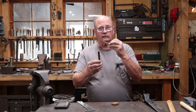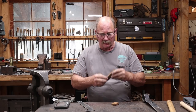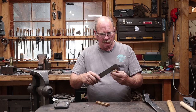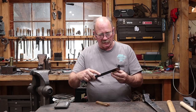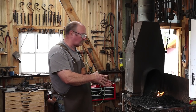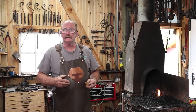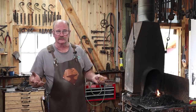His hook was a very nice contemporary or industrial looking hook, fairly much full dimension of the material for most of it, but I'm going to have to draw this out and make it a little thinner, a little more graceful. It needs a standoff — I'll cut that out of this. There'll be a punched hole mortise and tenon joint, and then a back plate. The only piece suitable for the back plate is about two inches by inch and a quarter, again half inch thick — so 13 millimeters by 33 millimeters by 50 millimeters roughly. Let's head over to the forge and make a hook.